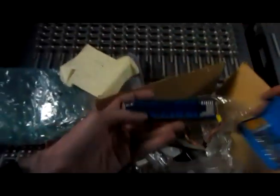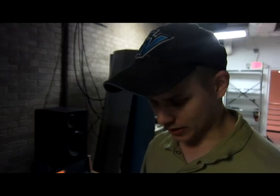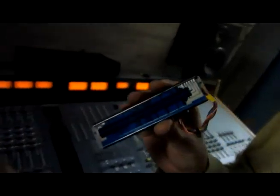These are awesome. You know how they make these, right? It's glass. It's printed. Well, it's not actually glass. Here's what I've read. Here's the process. They start with a sheet of metal, I presume incredibly smooth, very similar to what a printing press is. They proceed to screen print the conductive plastic, or the ink, on that, which they then injection mold plastic on the back side of. They add the contacts and conductive bits, obviously all at that stage, or just before that, and they peel it off that metal substrate, and where it was against the smooth metal forms the top surface, which is as smooth as it can get.